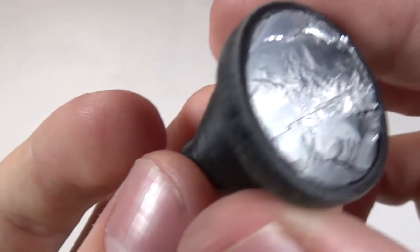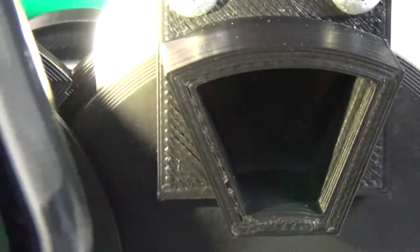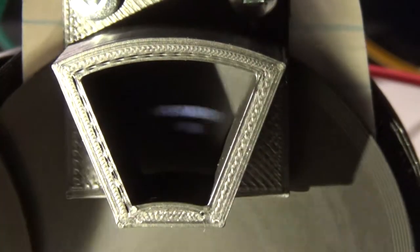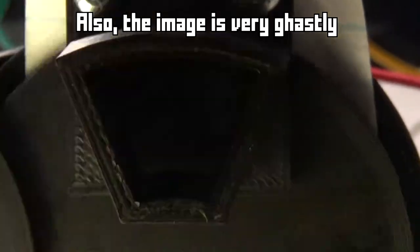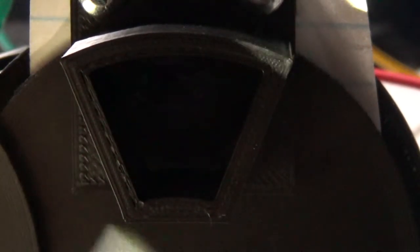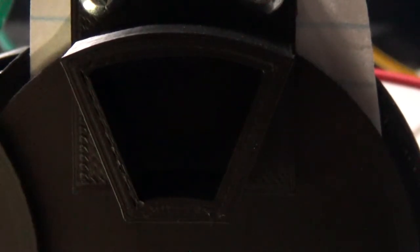I replaced the cavities with these cones, and by lining the inside of the cones with tinfoil and using papers as a diffuser, it should create a bigger area for the sensor to see the light, which it does. It still doesn't work right though. When I shine a dot onto the camera sensor, it represents it as a line and will only see very bright light. Nothing in front of the lens, that is simply just a light source.